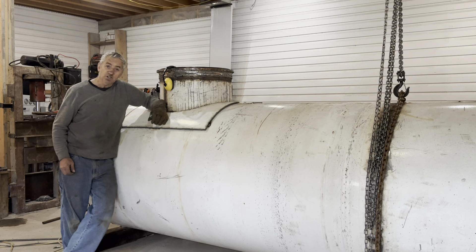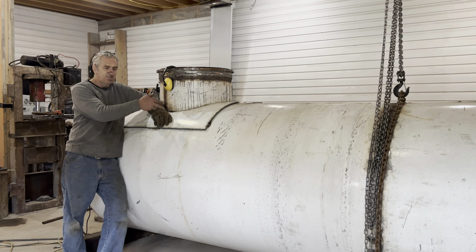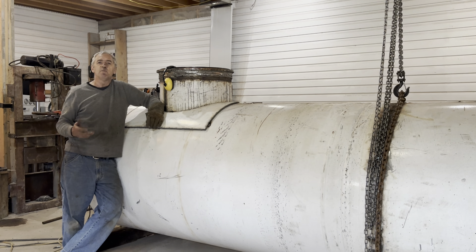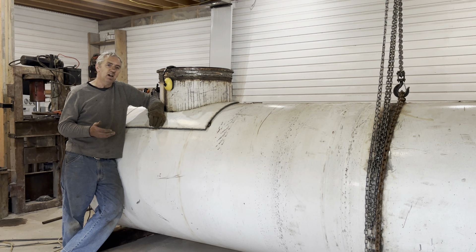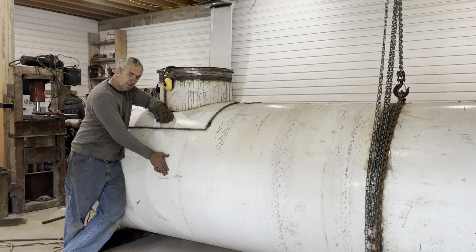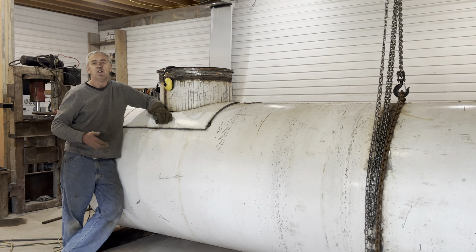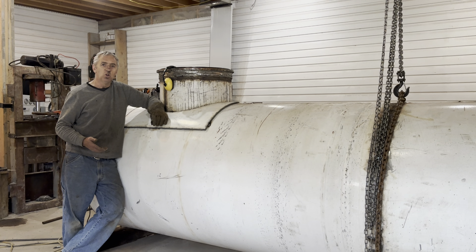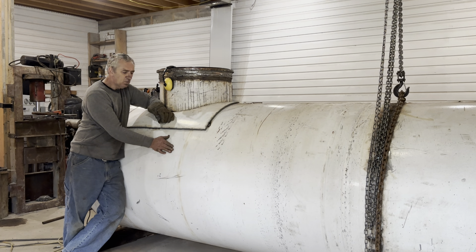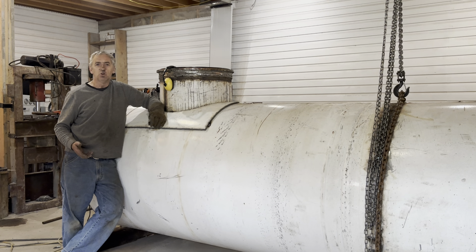While I'm cutting out all these pieces for the future parts of the submarine, I'm cutting out the bottom plate that goes inside the hull to create a keel cooler. So the lake water is on one side of the hull, and on the other side is a chamber which holds the antifreeze coolant — the contact between the coolant and the hull cools the coolant water. That's how you cool the engine.